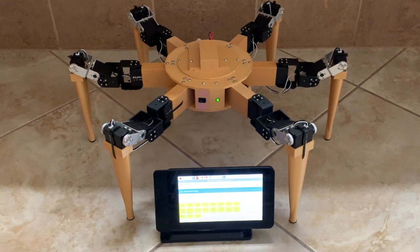The Arduino uses a PWM servo shield to control the servos. Unfortunately, the shield can only control 16 servos, and the robot requires three servos per leg, or 18 servos total, which requires two shields. On the top of the robot, there's a compartment that holds a 7.4-volt LiPo battery to provide all necessary power required by the robot.